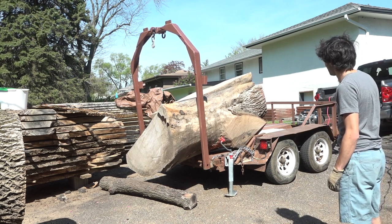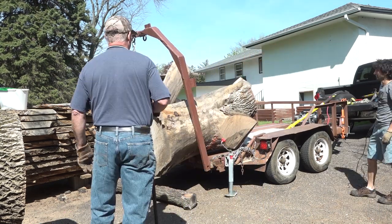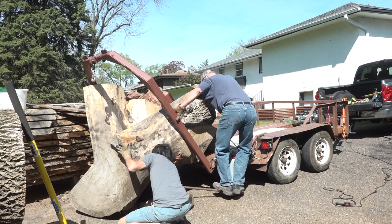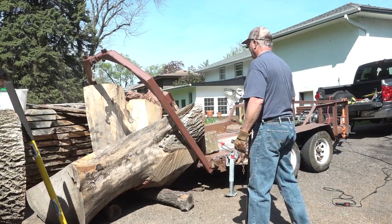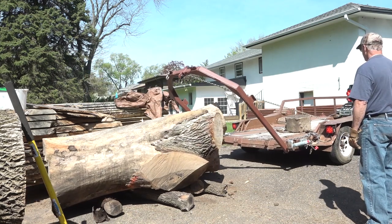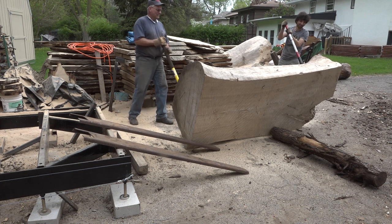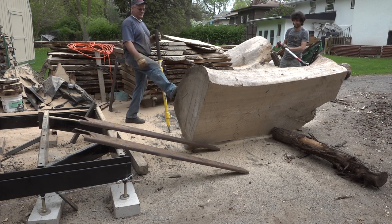So one of the things about running a chainsaw mill that wide that I totally forgot on this last cut was to make sure the bar is nice and flat. When I had the chainsaw mill set up the first time, I had the bar nice and level and parallel to the guide. And when we took it apart to put a new chain on, after the chain was dull after the first two cuts, I totally forgot to level that bar again. So the last cut that we did ended up extremely wavy, and it was extremely hard and slow to make that cut. I didn't think about it until afterwards, and I realized, hey, the bar's got a sag in it. I totally forgot to take that sag out, and instead of a 16-minute cut, that cut was like 40 minutes or something ridiculous. So, lesson learned there.